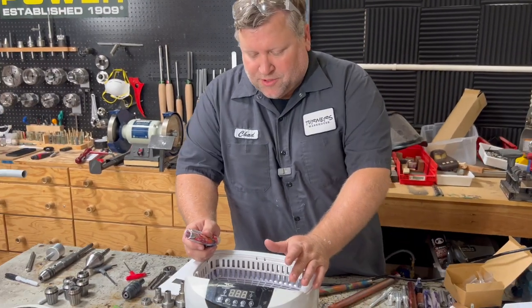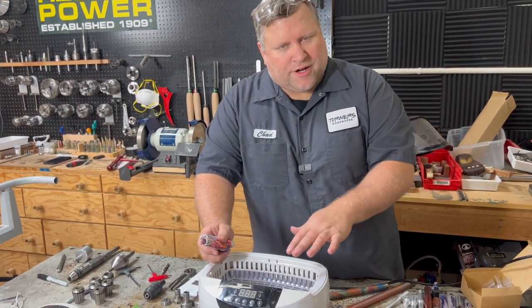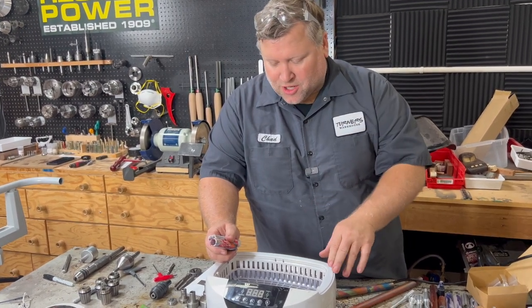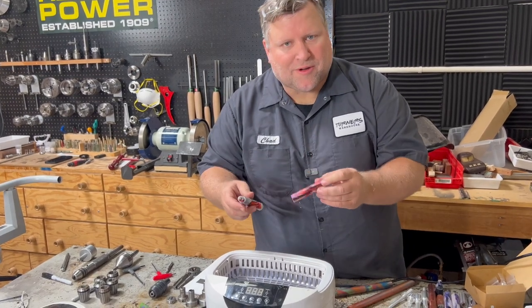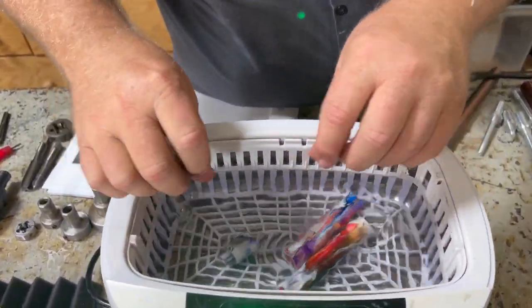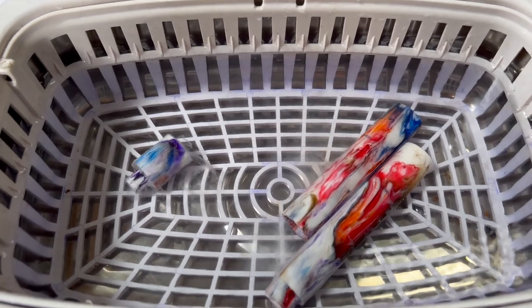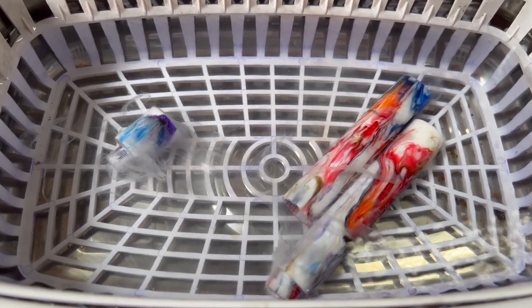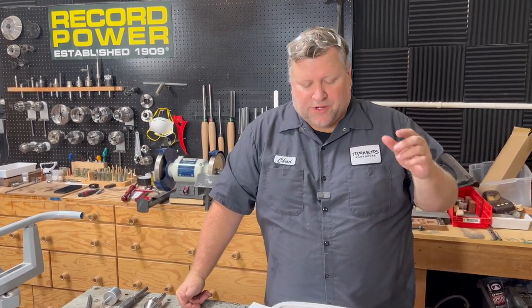This is just a very simple ultrasonic cleaner — I've had this thing for years. It's just got water in it now so you can see it working, but I do like to put Simple Green or some very mild cleaner in it. I like to clean them, put them out to dry, and just let them dry or blow them off with air. What you'll see is the WD-40 will kind of look like white coming off, and then you'll start to see little chunks coming out of your parts — basically the dust from working. It really does a great job of cleaning. I hope you liked this video of making the section — this is part three. Be sure to tune in to our next video where we do all the shaping and finishing and complete this fountain pen. Thanks for watching!